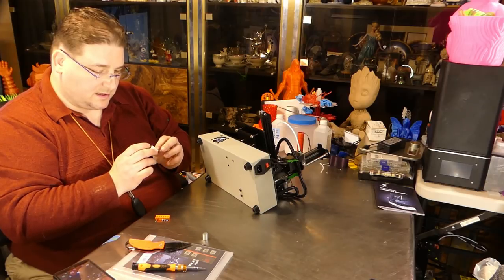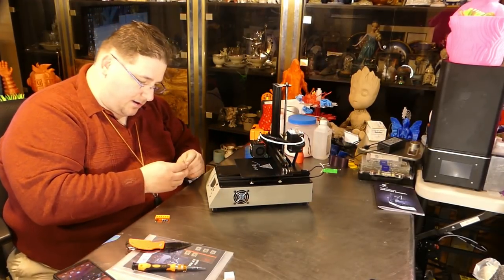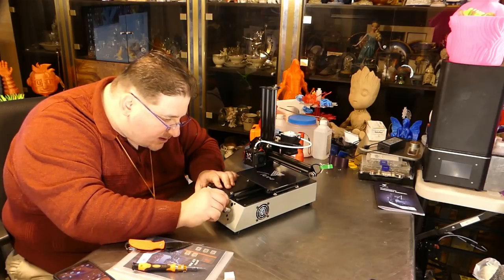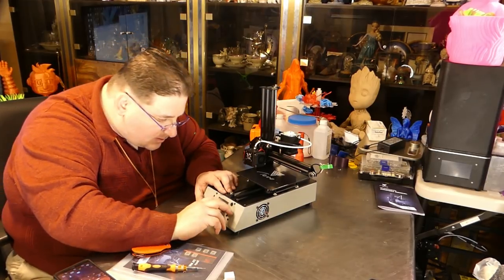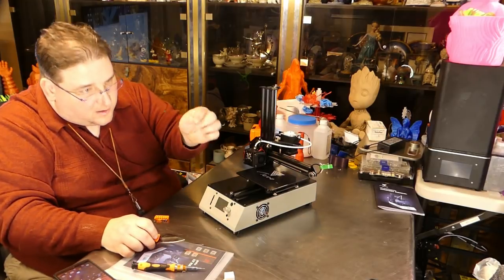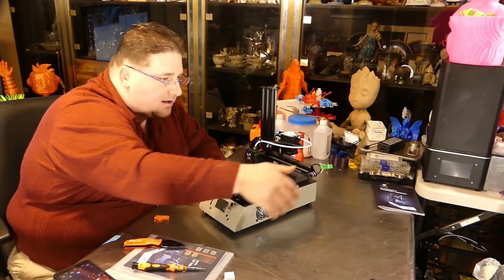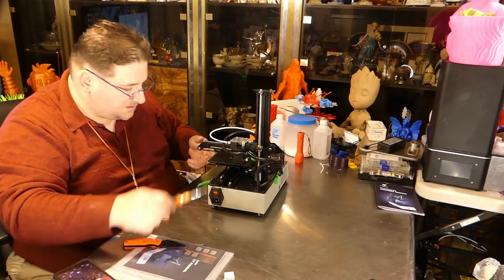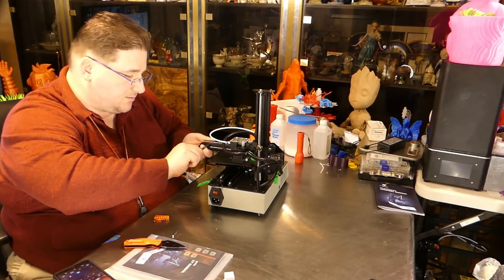Hey, the sample print — my first one wasn't exactly straight but this one's pretty nice. The heat bed is already attached; just slide the knob on. There is protective plastic film on the bed — let's get that off. One belt is already tight, but the other one is too loose — I would deem it too loose. You can see how it just flops. Same as past printers, tensioners are built in — loosen this one, loosen this one, tighten it up.